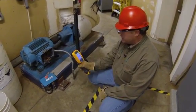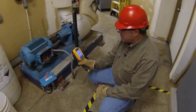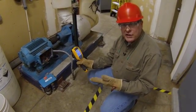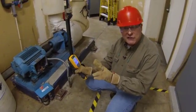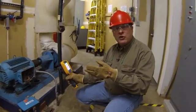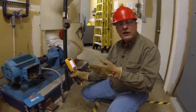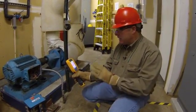Also looking to see if there's any overload situation on any of the lines — I'm not seeing anything there. A single-phasing motor may still be operational and working, but you're going to see two of the phases significantly warmer than the one that was shut out; that one will be a lot cooler. And that motor will start overheating and draw more power just to try to keep running. So definitely look out for things like that. No issues there.